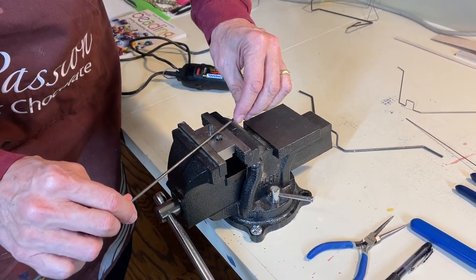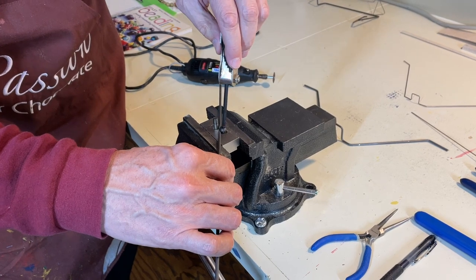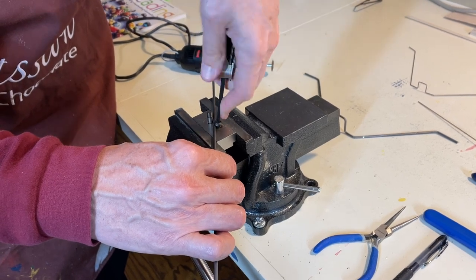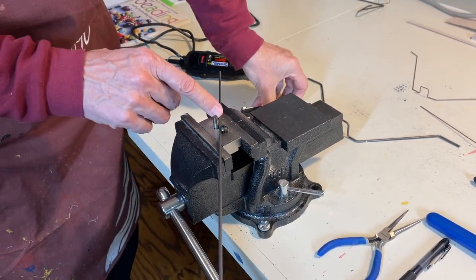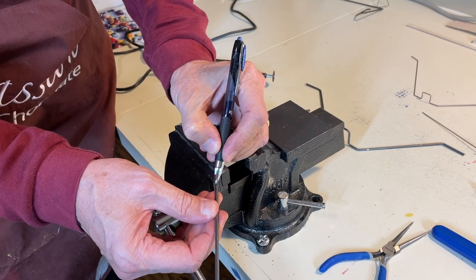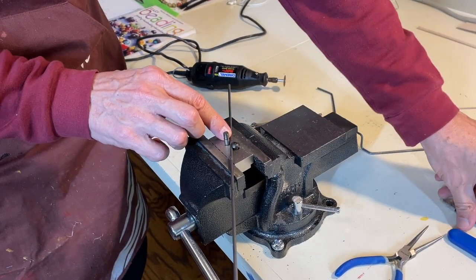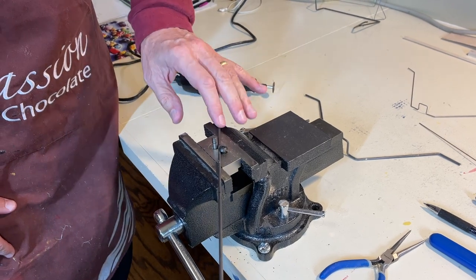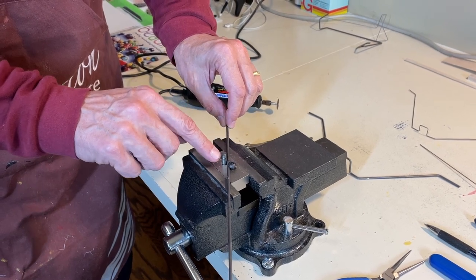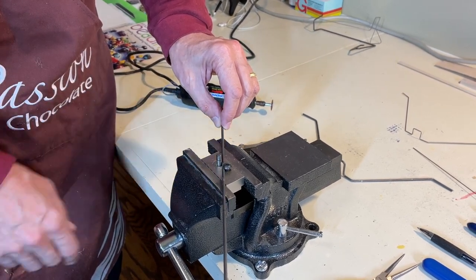So let's go ahead and do a few bends. The wire goes in place like this, against this bolt right here. This bolt is an Allen wrench — it controls it so we can screw it down to hold the wire in place. I use a gel pen to mark a bend location on the diagram — you can see a very light blue mark. That's the way it's going to bend around. Because of physics with machine tools, this is 1/8 inch wire and this is a 1/4 inch turning post — it works out fine for the diameter of the 1/8 inch wire.